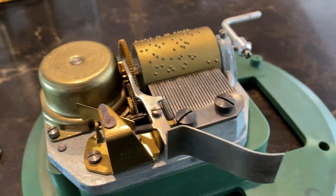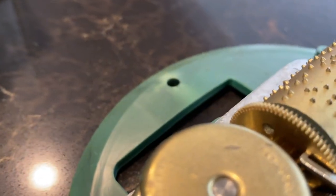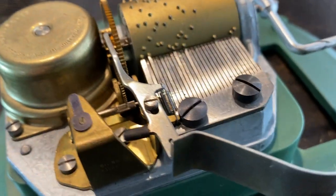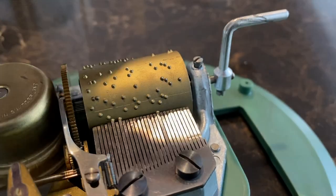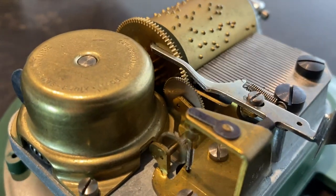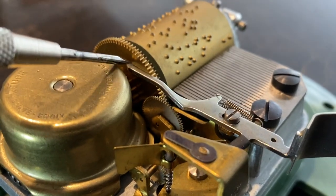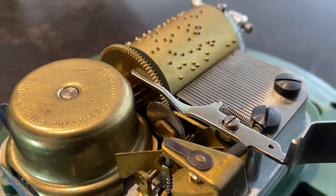So with that said, I'm going to push the button and you'll see how it operates. We've just released it — you can see the hole in that gear as it goes around; it'll come and that little point will drop in to stop it. You can see the outer shaft going around to turn and open the doors on the cigarette box. You saw the fin here stop as well — when that peaked, the point fell into the hole. There's tension on that spring to pull it over; when it hits the hole, it stopped the song.